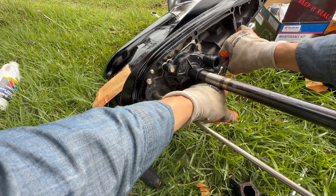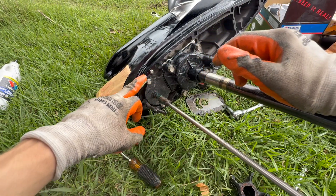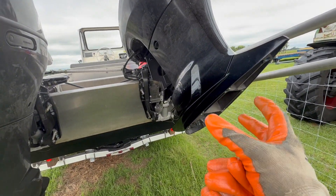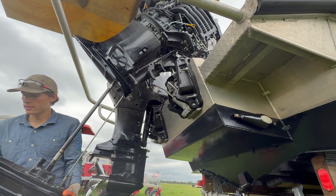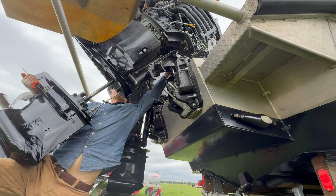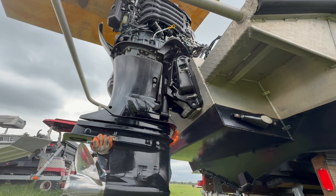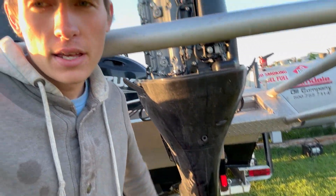While you're here it doesn't hurt to put some grease on the shifting parts and clean any corrosion off the little studs. Now get the lower unit and put it back up inside the engine. Reinstalling is basically the reverse of removal — push it back up where it goes and lower the motor. You may have to rotate the shaft a little so the splines line up. By the next morning the bottom end is back together — it basically goes back together the same way you took it apart.